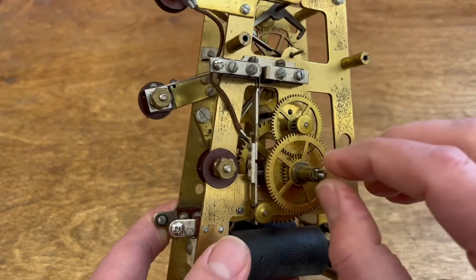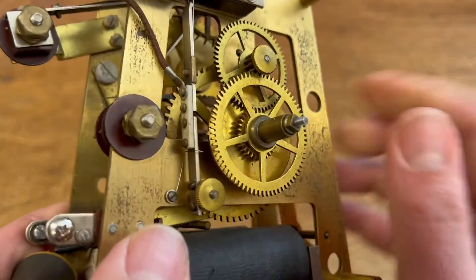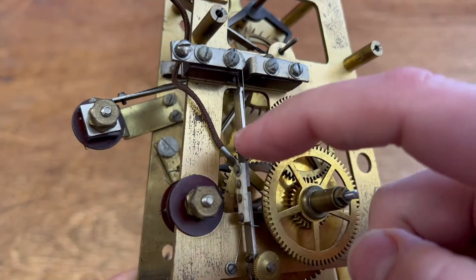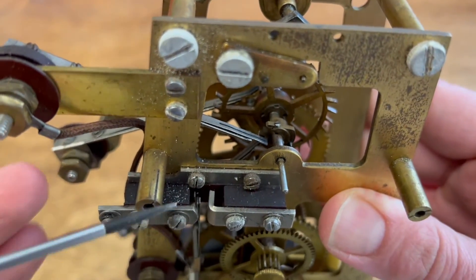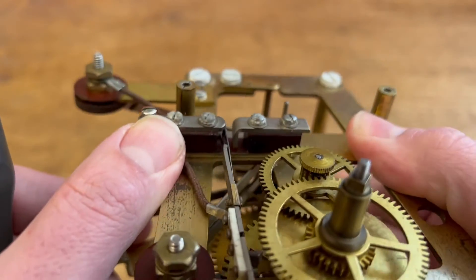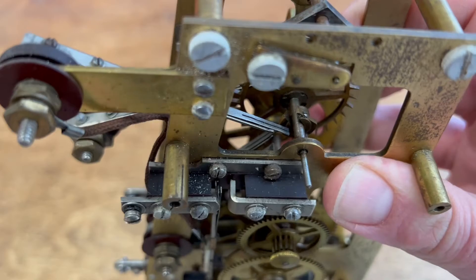On the front of this, we've got some other contacts — on the hour wheel there's a little nub coming around. You can see it right here. This nub pushes on this contact. You can see that we have an insulating spacer between these, so there's metal here and then a gap before this contact. If we look really closely, we can see there's probably something wrong here. This contact has a pin that goes between it, and much like the rest of these contacts, it's a double little diving board thing. It's set up so that one of those contacts is on either side of the pin — so essentially it's always in contact with the left contact. I believe that's incorrect; we'll have to take a look at that.